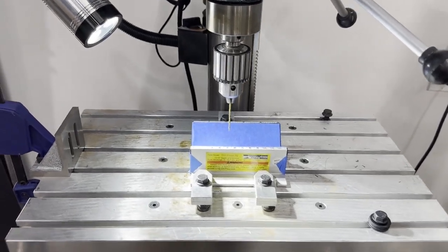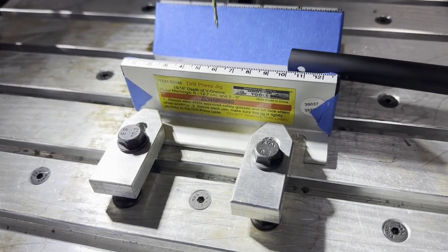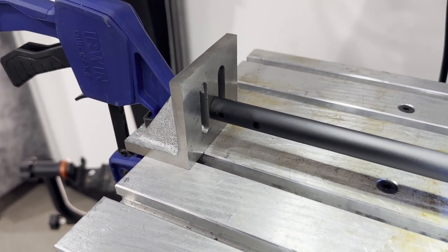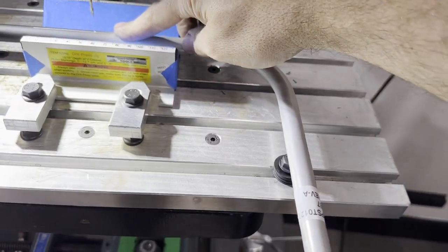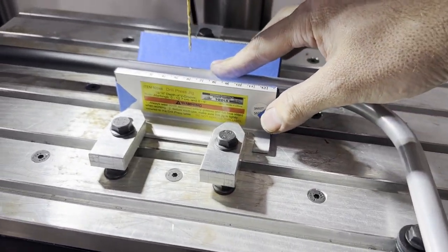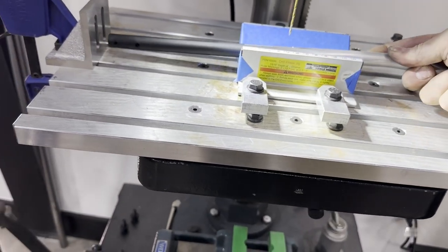Here's the setup I'm going to do. I'm probably doing a little overkill on this - it really probably is not critical, I could just hand drill that, but I got the tools here to do this, so why not? I've got my drill press jig, my v-block here to hold the tube in place. I've clamped an angle plate here for a stop so that I can get them all at the same dimension, which is eight and a quarter. And over here I've got this block that holds it up so it's parallel to the T-slot plate on the drill press. Let's drill some holes.